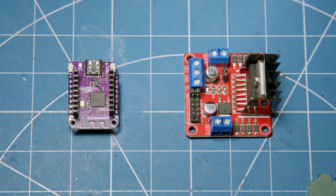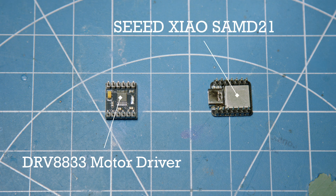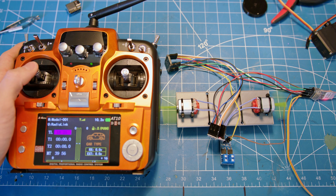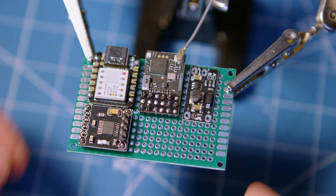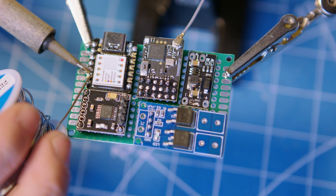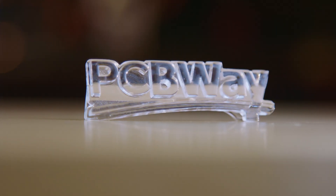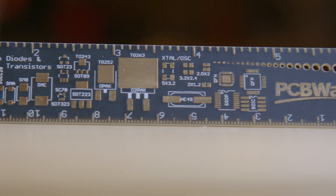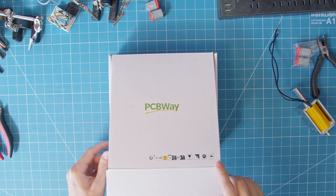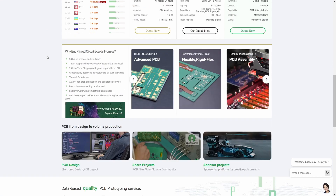Inside the housing the gears slot into a cutout in the top and bottom lid, allowing the entire grenade to rotate around the motors, propelling it forward or backward. With that sorted, I focused on finding the smallest electronics I could — using the truly tiny DRV8833 motor driver and the equally small Seeed SAMD21 microcontroller, I wired together a quick test to ensure the motors played nicely with my transmitter before soldering everything onto a protoboard. While a protoboard is great for quickly combining components, next time I'll turn to this episode's sponsor PCBWay to have a custom circuit board made instead. With dozens of options for PCB prototyping, 3D printing, CNC machining, and more, PCBWay makes it incredibly easy to bring whatever you're working on to life — check out the link in the description.